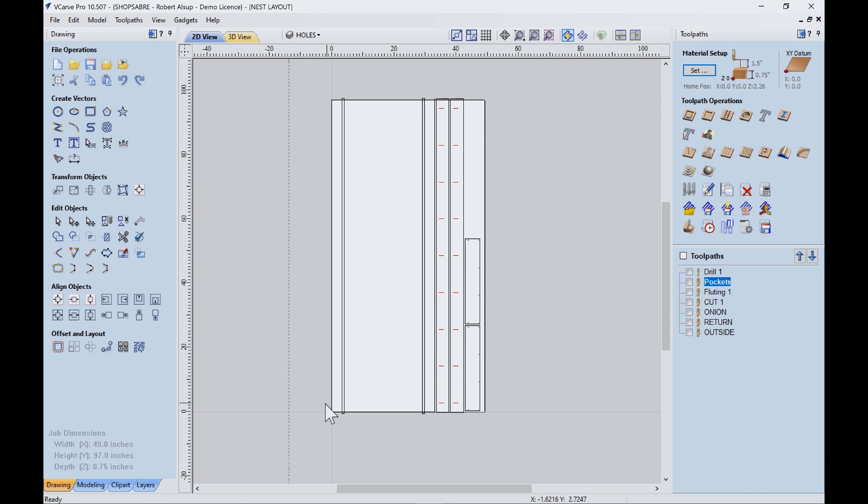This is a four-by-eight sheet of three-quarter inch white melamine. We use that because it's a really nice smooth surface and it's pretty flat. What you see here are actually grooves cut into the material surface about an eighth of an inch deep, and the longer side pieces fit into there — that ensures the alignment. Then what you see here are actually slots for pocket screws, so those get fitted in there and pocket screws are used to actually attach that.